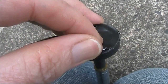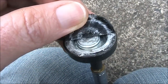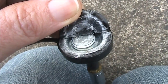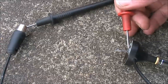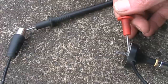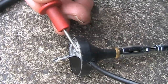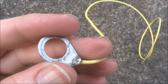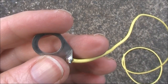I also suggest looking at the base. With a small screwdriver I've peeled it off, and you can see the magnet that holds it to a metal surface. In my antenna, the magnet is connected to the outer of the coax feed line. This makes it a point to which we can connect a radial — 50cm of wire soldered to this connection, with a pad large and flat enough to fit underneath the magnet.